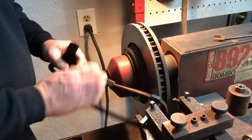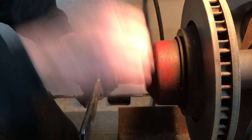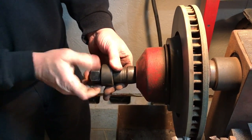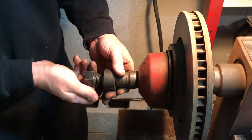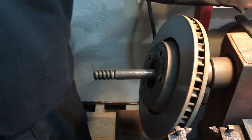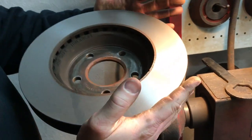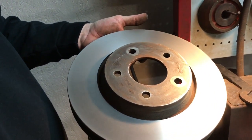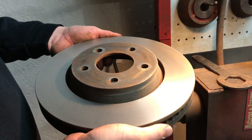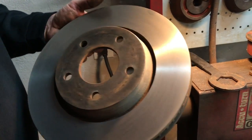I decided I'm going to show you removing the rotor. Take your band off of there, take your wrench and go in a clockwise motion — you can just tap it with your hand a little bit — and take your nut off. Then remove your cone and spacer and set them right back up here so they'll be ready to go next time. Friends, here's our rotor — it looks nice, it's ready to go. One thing I would recommend before putting a freshly machined rotor back on your car is to actually wash this with soap and water and blow it off. That will help demagnetize this rotor and get all the fine dust off of it so it doesn't embed into your brand new brake pads.